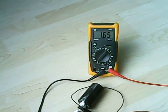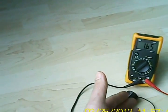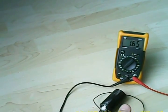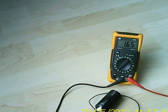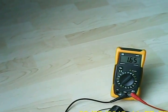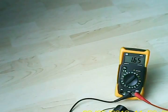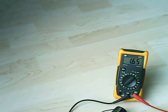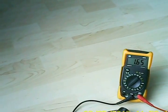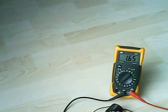For now, this is the first step. You can do it any way you like. You can take a piece of paper, write down all you did, all the voltage per cell, and every time keep record of it — which is a good way. But I like to do it quick and easy because I have done a couple of these already, and I know if this method, which I am showing you in three parts, is working. If the battery is rejuvenated after a couple of times, it's okay. And if not, well, you just throw away the cells which are bad and keep the healthy ones for other projects.